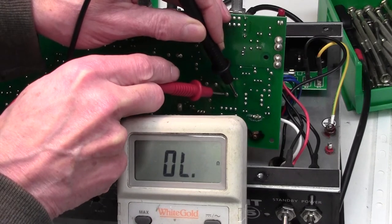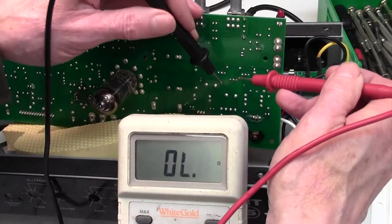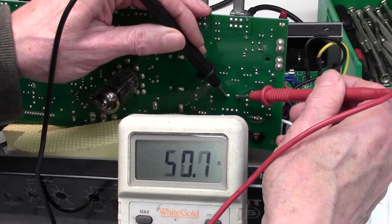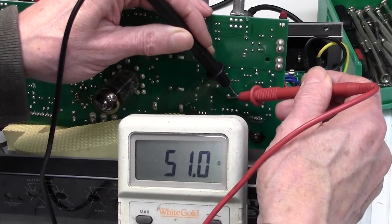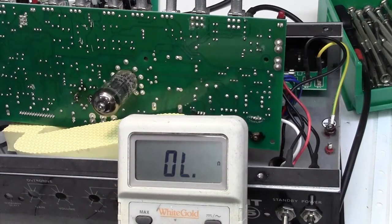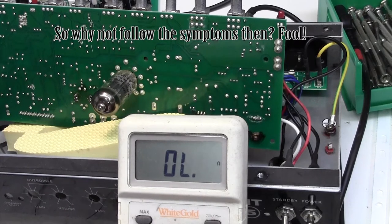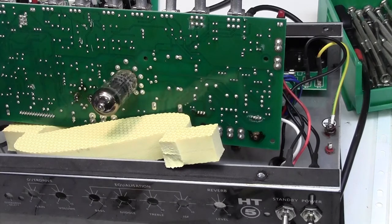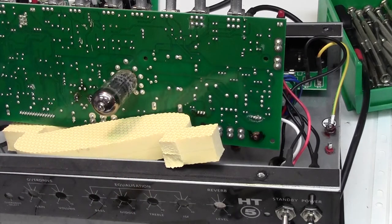How about this last one? That's very interesting — we've got 50 ohms both ways there. It's possible there's something in the circuit, but I think that capacitor there may be a bit suspect. Of course, it's got all the symptoms of a faulty smoothing capacitor — we've got massive hum on the signal, which would imply a faulty smoothing capacitor. So I'm going to take that out and test it outside the circuit.